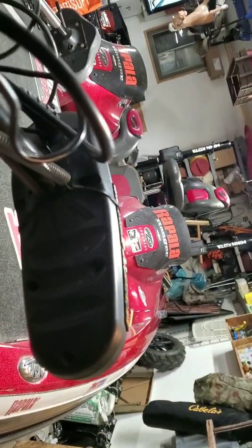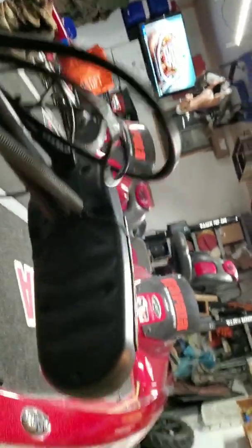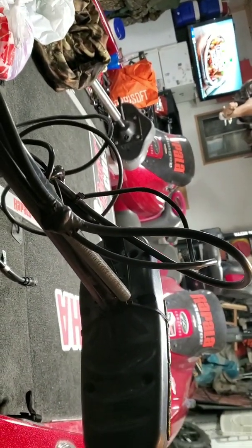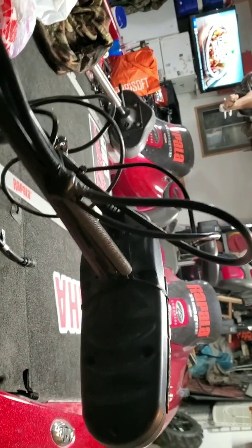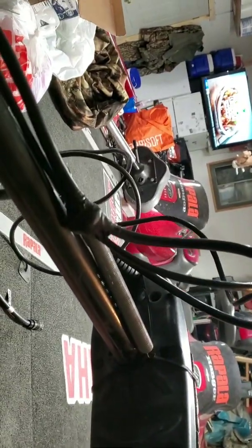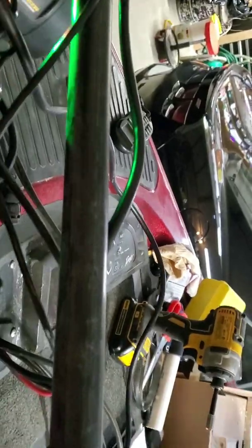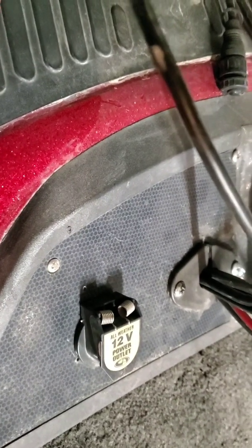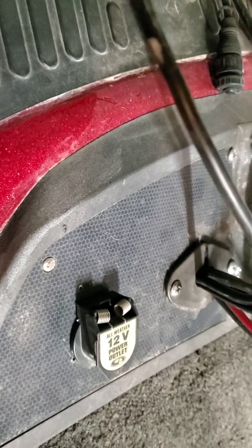And then if it tightens up, you got some spring play. You can see quite a bit of play there. You don't want a stiff spring on there. And the reason why you don't want a stiff spring is it could damage your cable. So you want a nice, flexible spring. Again, you won't be overextending them all the time. Then the cables ran down through there. They're going to loop back, and I'm going to have to create yet another hole because I don't have space in here to bring in the transducer cable to the module.